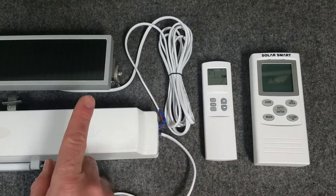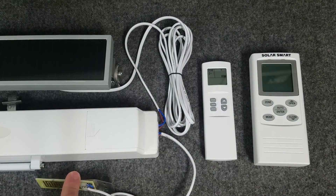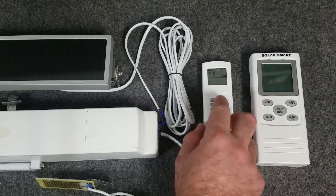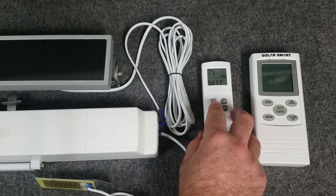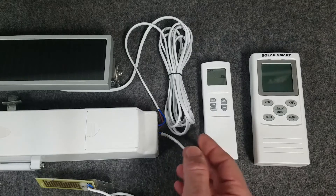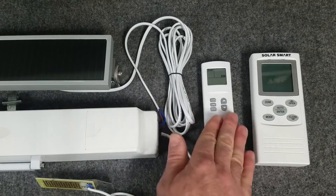Since this is per each operator, I'm going to select the operator in which I want to enable the rain sensor — in this case, 1-1. Hit Enter. By default it's off. Push the up arrow until it's on, then hit Enter. We get the word 'success,' and now it's enabled. Obviously, if it said 'fail,' we didn't have proper communication between the remote and operator, and we just try that again.